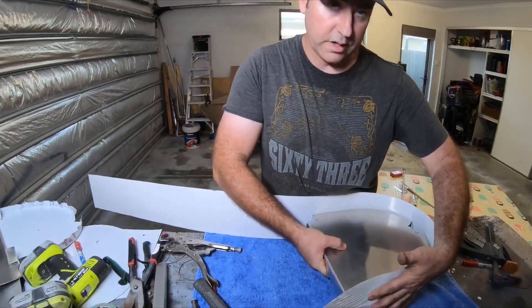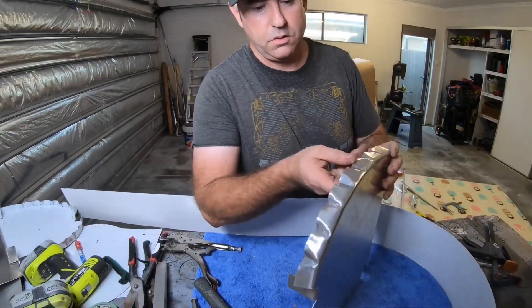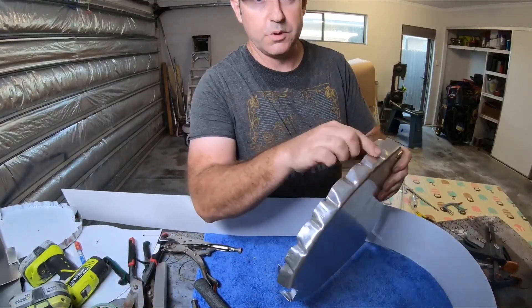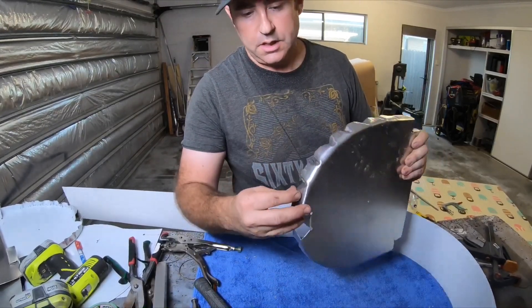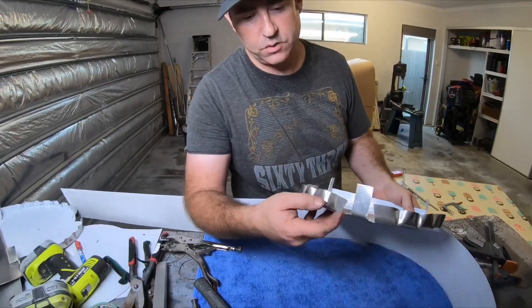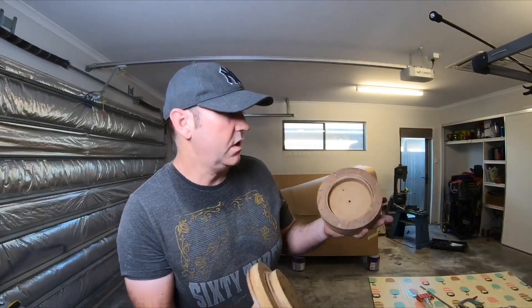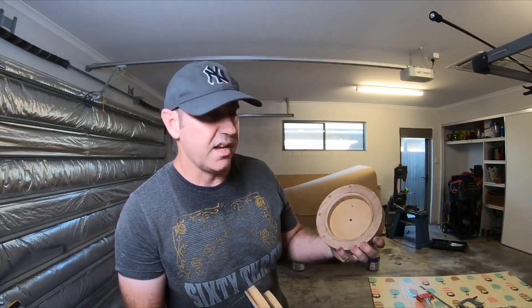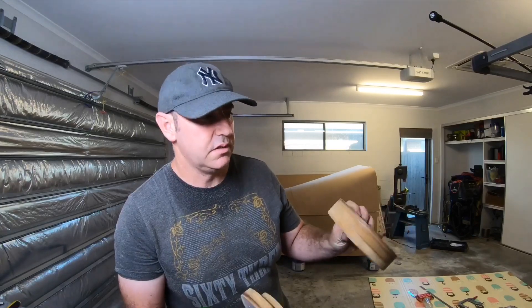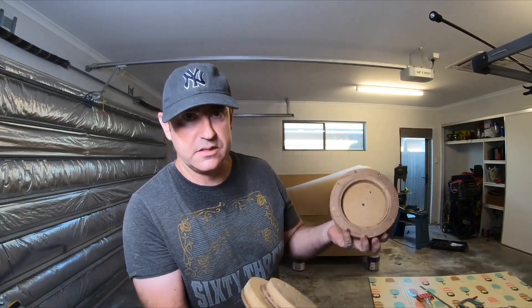The external skin will just run around the whole lot and get riveted in. For the flat points there are 40mm spacings on the rivets, so when I was working this out I made sure that all the crimps weren't where I needed to pop rivet. The flanging tool is just made from a router and timber — MDF and some ply — with two mating surfaces.